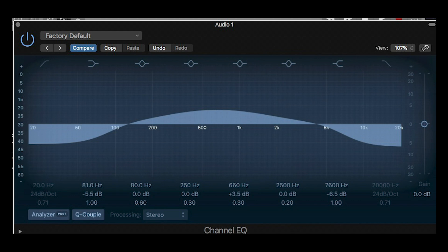That's the Heil PRAS — the Parametric Receiver Amplifier System. It works well. As an audio system it certainly adds quite a bit to the station. It's not primarily intended to grab signals out of the noise — it's not a noise reduction system, that's taken care of by DSP which is probably built into your transceiver anyway. It's more a question of bringing the audio forward. If you amplify the mid-range frequencies you tend to make the voice come forward, making it crisper and more prominent.